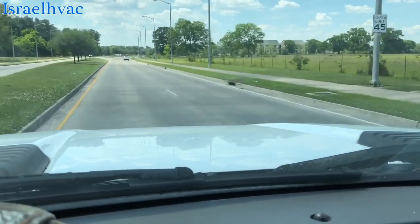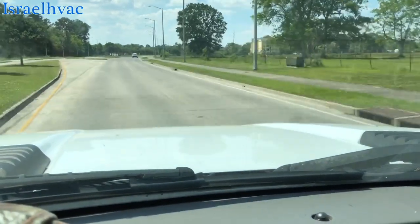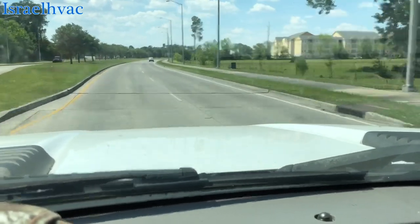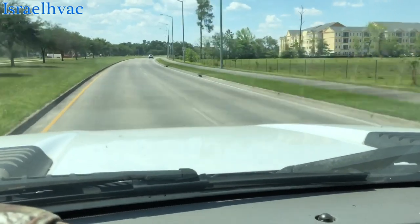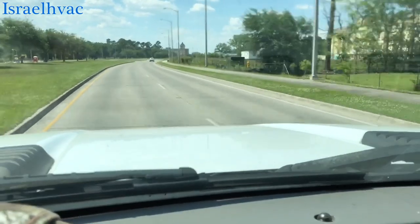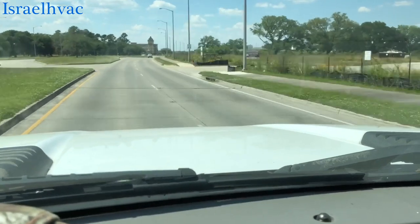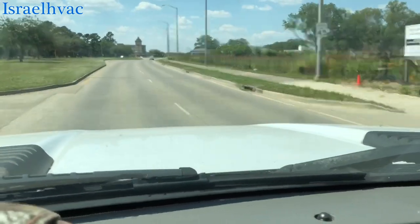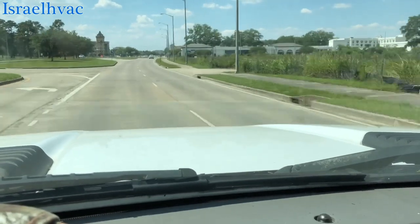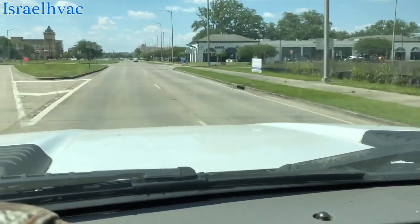I was trying to get a hold of Goodman. Goodman has an emergency cell phone that the counter people share on call, just like we do here in the field, and it's provided to all contractors. Even though we're not a Goodman dealer, they'll come open up the door for a fee. That was a 42 frame motor — I don't have a 42 frame motor on the truck. I'm going to need to put one on here now that I'm thinking about it.